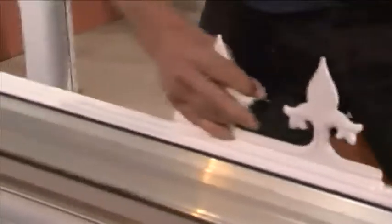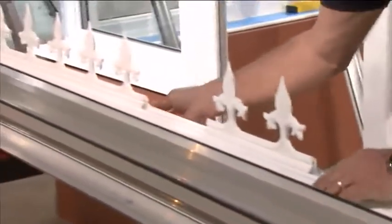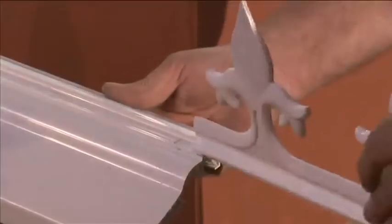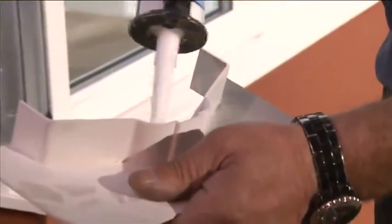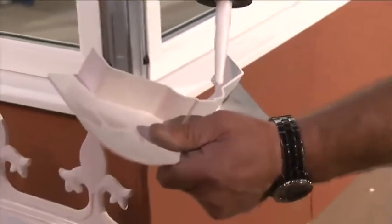Slide the pieces of cresting onto the external ridge cover through the molded grooves from the opposite end of the external ridge cover. The last piece of cresting may have to be trimmed. See your installation guide for instructions. Run a bead of silicone around the contact faces of the flashing trim and attach to the ridge assembly.